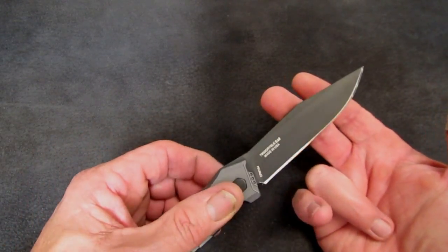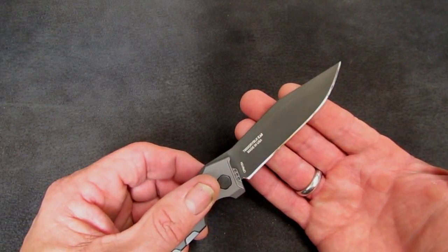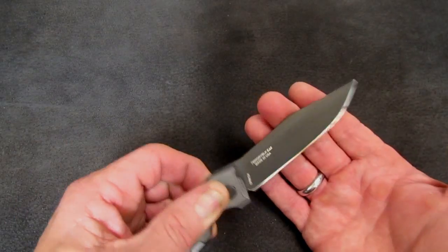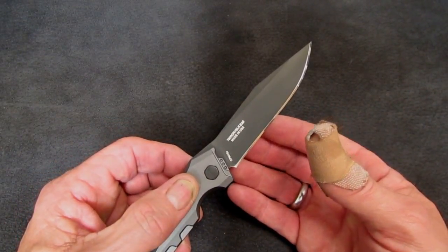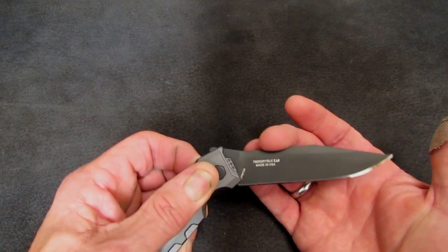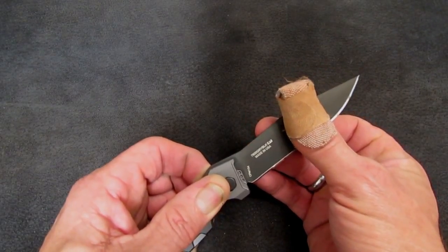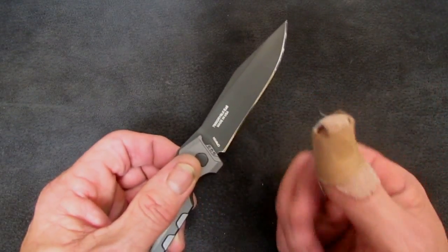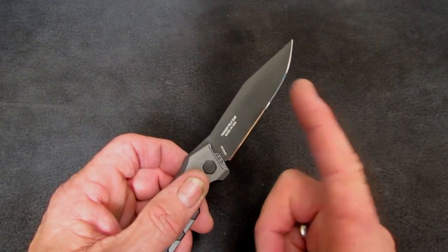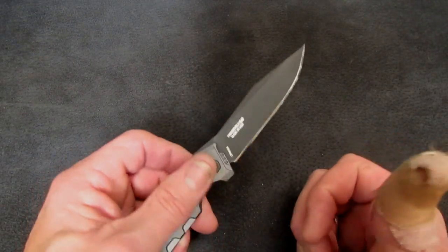Some of those earlier knives in the series had a combination of factors that weren't executed very well. If you would adjust the pivot to a very free state, meaning maximum velocity as it hits the stop pin, that was a contributing factor. The other one was that those knives ran out of gas as far as the spring goes at about this position. So the knife was almost free between the stop pin and, let's say, 10 degrees down. So it was able to bounce off the pin and have no spring tension sucking it up against the pin. That, coupled with a very free pivot, put the knife out of time, and you had issues.